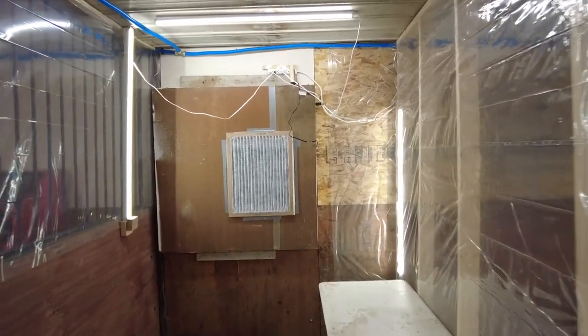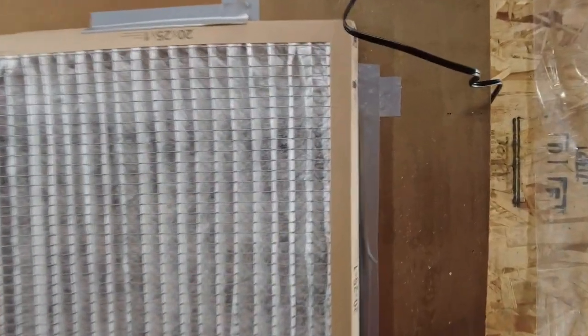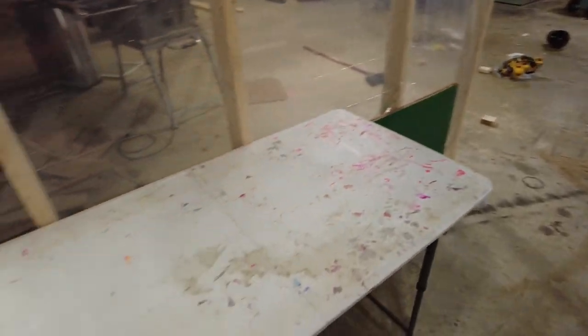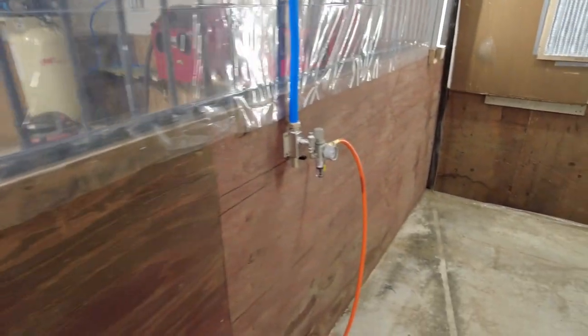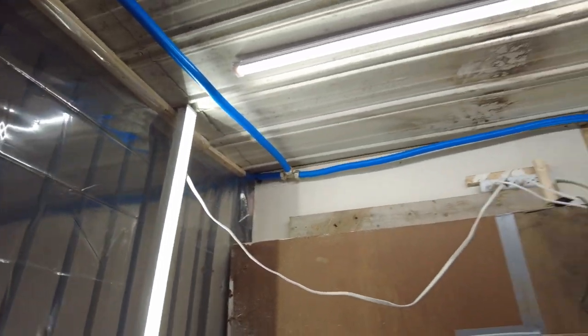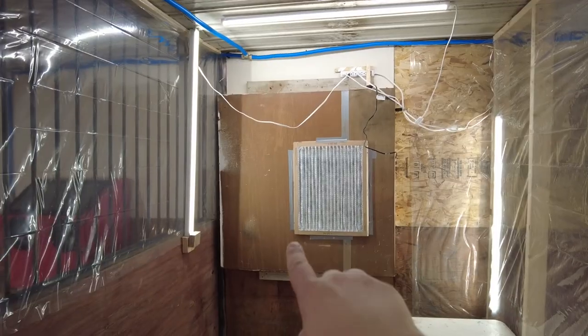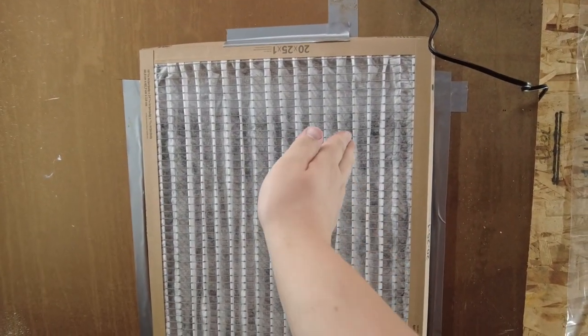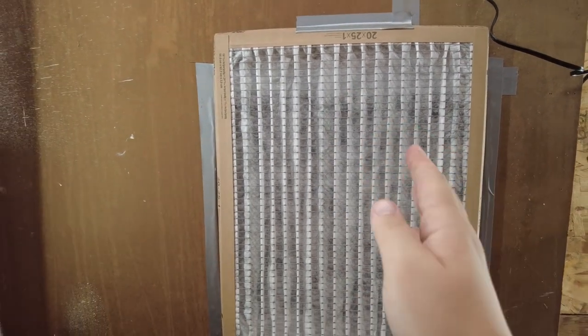It's definitely not pretty, but we officially have a Cerakote booth. I did everything I could to build this with as low a budget as possible. All in, it cost me about a hundred bucks — the biggest cost was six two-by-fours at about six bucks each, so around 36 to 40 bucks. Then there's a box fan behind here for another 20 bucks, the filter is another 10 bucks, plus the air nailer and plastic for both the dirty dungeon and the opposing wall. My favorite part is it has lights going all the way around, so when you're painting something, there is really even lighting with no shadows. Before I moved into this new shop, I used to have to paint outside — I scrapped so many parts because I just couldn't see what I was doing.